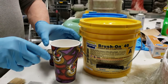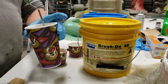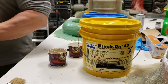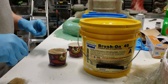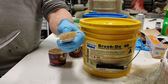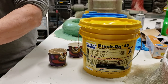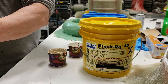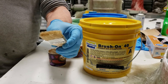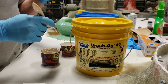When using the big cups, I mix right down to the bottom, and once I've gotten about this much out I'll go back in and make sure I've gotten everything up from the bottom again - you want to make sure it's really mixed thoroughly. For the very first coat you put on, use a brush. I just cut the very first quarter inch off the bristles so it gives you a really nice stiff brush to work with, and it's good for getting this stuff on.